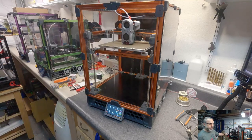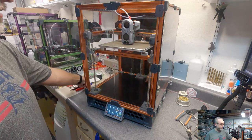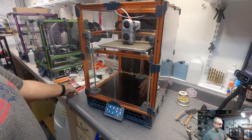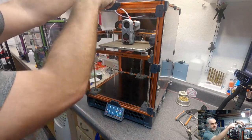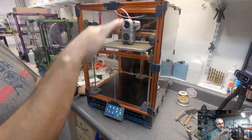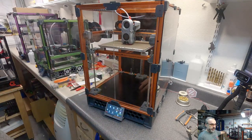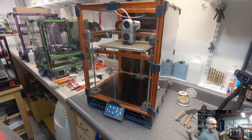I have lots of problems with the black V2. This is my original printer, but I have a physical, confirmed with a reasonable straight edge, bow to the bed. I can hold this up here and see a significant amount of light in the middle. It is physically tacoed, so I can't say whether anything else is contributing to any first layer issues I have on that guy.